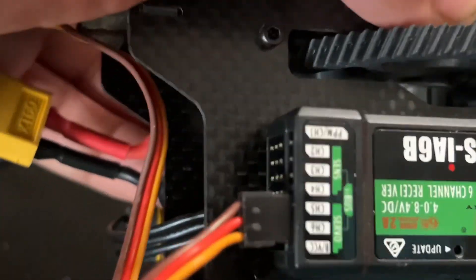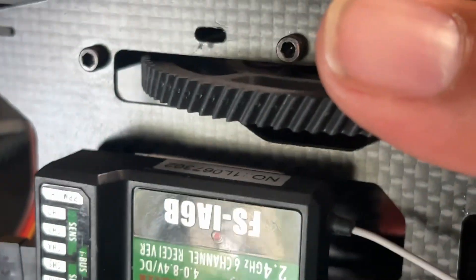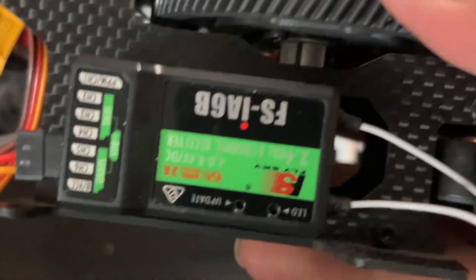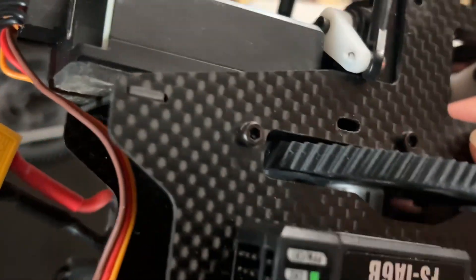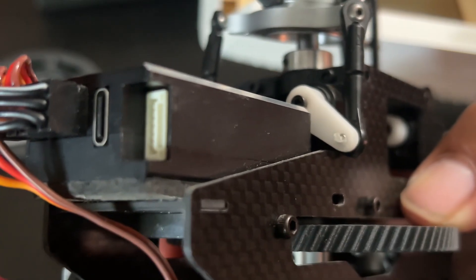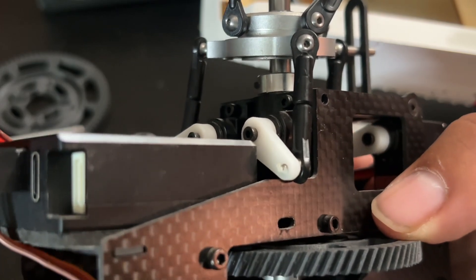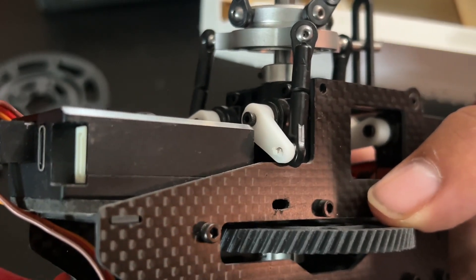So we just finished the outside bench test. Putting everything back together, but I did notice something — you see those little imprints? That's from the metal gear biting in, and it's pretty much on all of the teeth. I'm wondering if that's going to cause any issues. Looking at the other side, the gear slits are doing just fine, so we're still going to take it up. In the near future we'll increase the wall thickness and probably increase the infill to about 75 percent.